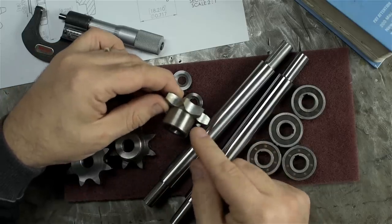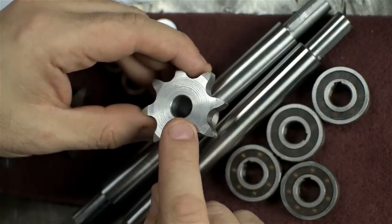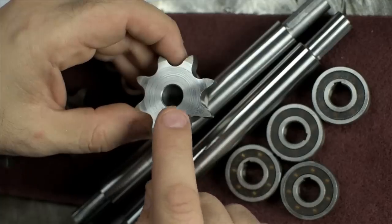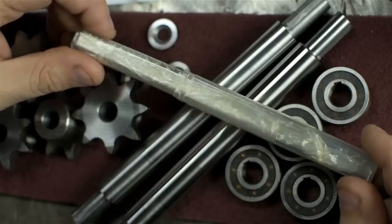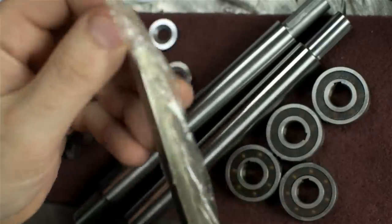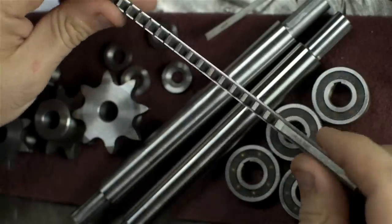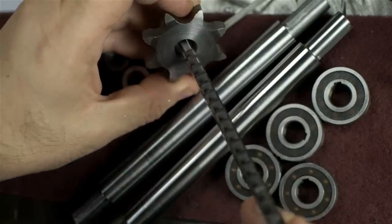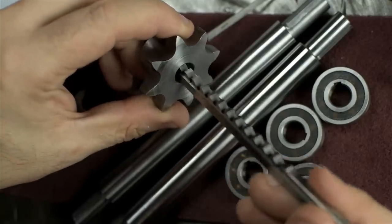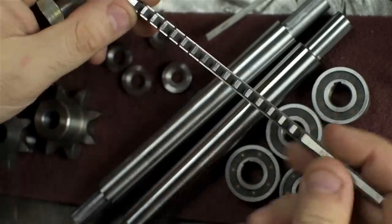There's a step and an overall dimension I need to work to. I was actually looking forward to cutting that in the filing machine — it's small, it's four millimeters. I thought I could plunge mill most of it and then clean it up on the filing machine. As I was looking for a file to fit these dimensions, it dawned on me that I had a four millimeter broach. I've actually never used this before — it's still in its original plastic and sharp as a whip. Apparently it came with a shim too. What I don't have are the bushings for this. So this is pushed through the sprocket in the press, cutting the slot for the key, but I need a bushing to keep it in place. I'm going to make that bushing. Before I do that, I'm going to take the sprocket to final depth — thickness — just so I'm minimizing the amount of broaching this little thing needs to do.